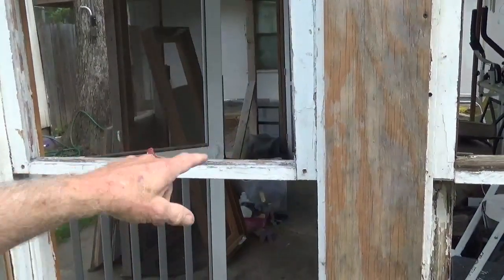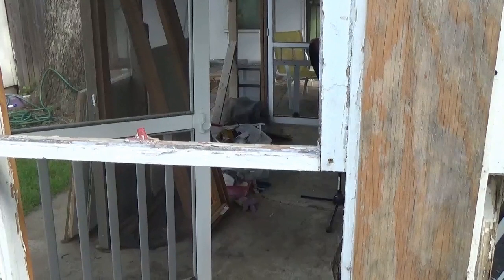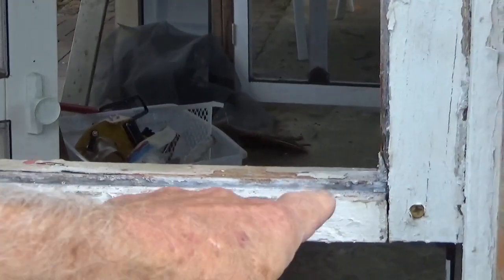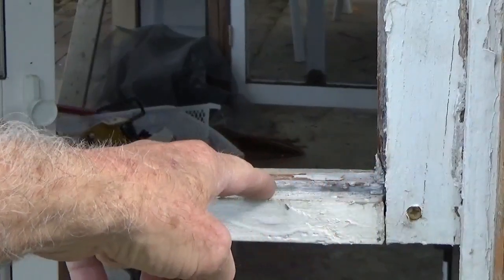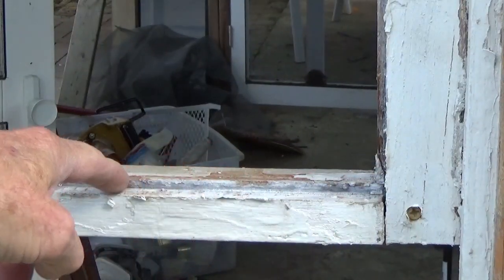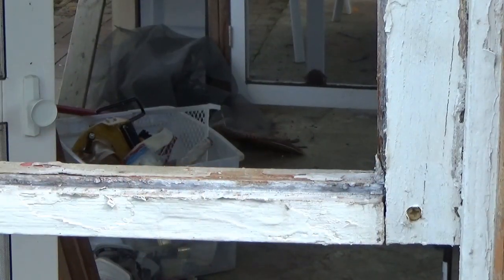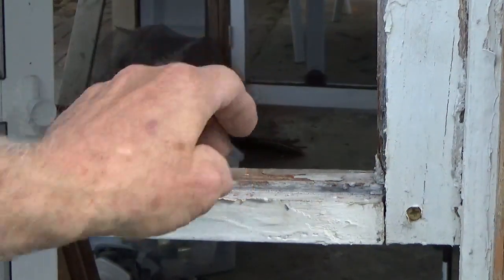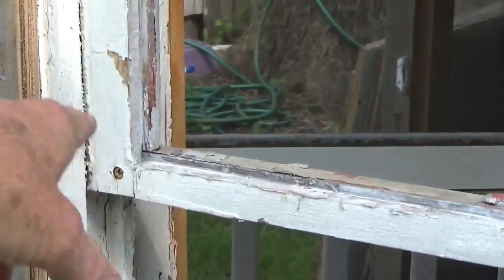What I'm going to do — I don't use points. I put a little bead of caulking on that inside rail, or I should say on the inside stop. This is the rail, and this is the stop here where the glass goes in and stops. I put a little bead of caulking all the way around, and that's what's going to hold the glass in.